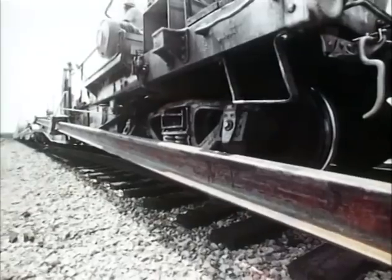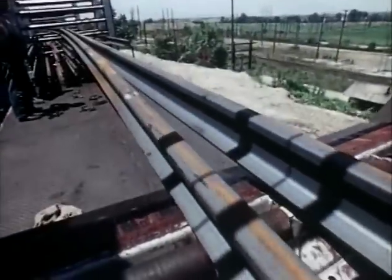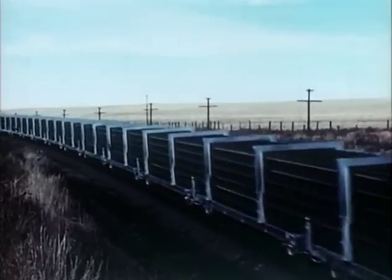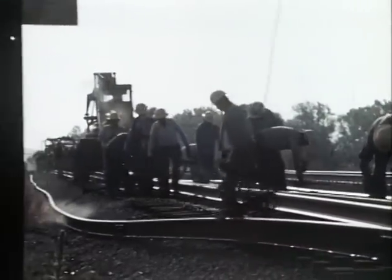Santa Fe has a tradition of finding better ways to move the flanged wheel over the steel rail. Using today's technology to prepare for tomorrow's challenges, research experts continue searching for ways to maintain Santa Fe's position as a leader in the railroad industry. There have been many innovations to improve train performance. For example, Santa Fe now has laid over 5,000 miles of continuous welded rail. Regular 39-foot rails are welded into lengths about a quarter mile long and hauled to location aboard special trains. The new rail flexes like spaghetti as it's put into place.